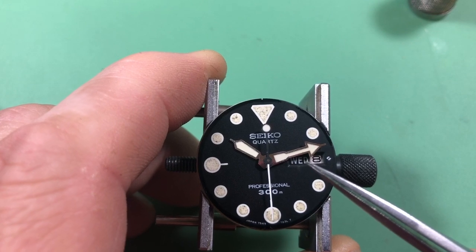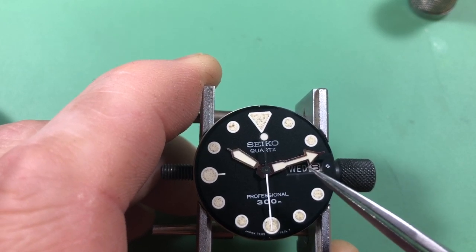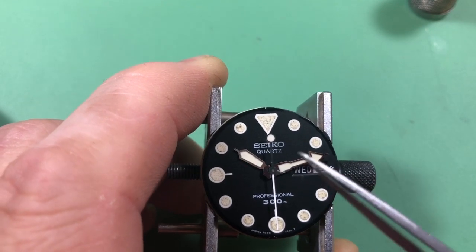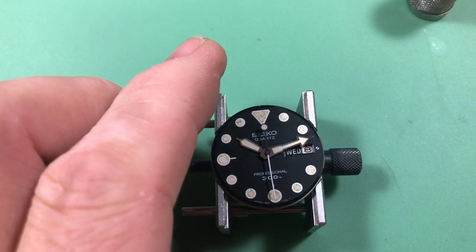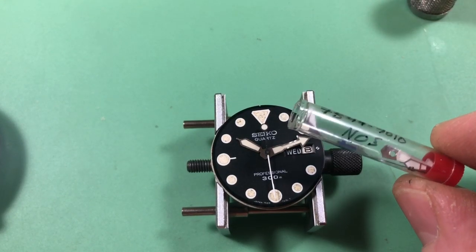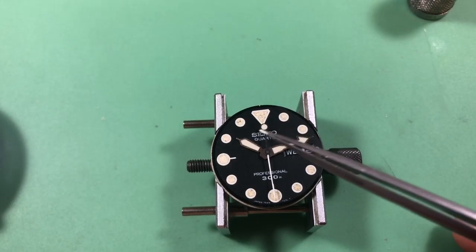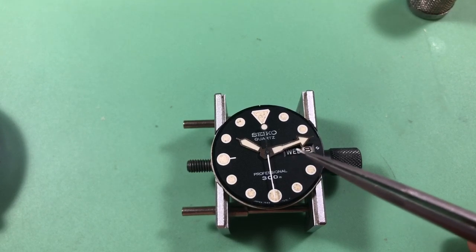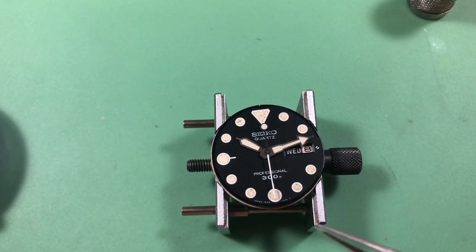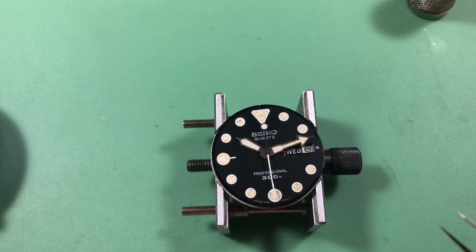Secondly, of course, you have a black day wheel, which is real interesting. So we need to talk about if you want me to put this back to a white day wheel, because this whole thing has been converted from 7549 to 7548 because you had elected to keep this handset. I could in theory return this to stock, because there's an original handset for 7549 right there. But I'd have to swap out everything underneath the calendar: the hour wheel, cannon pinion, hands, a bunch of other stuff underneath here would have to be changed. But I believe that you elected, I'll have to double check when the stuff is going through the cleaner, to leave this as is. Which we certainly can do.